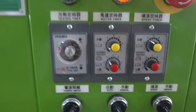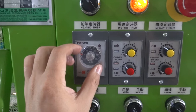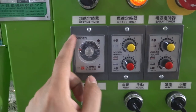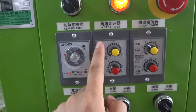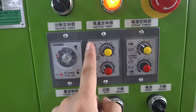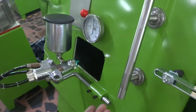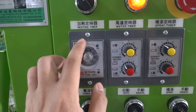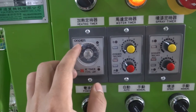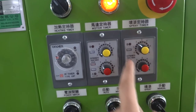You can see there are 3 timers. This is the pre-warming time — you need to set this timer. Control these 2 timers. The first timer is for when you are heating: it will make the drum heat up and make the slider hotter. Once it reaches the set temperature of 90 degrees and the timer reaches its time, it will jump to the spraying timer. The spraying timer controls both the spraying time and the stopping time.